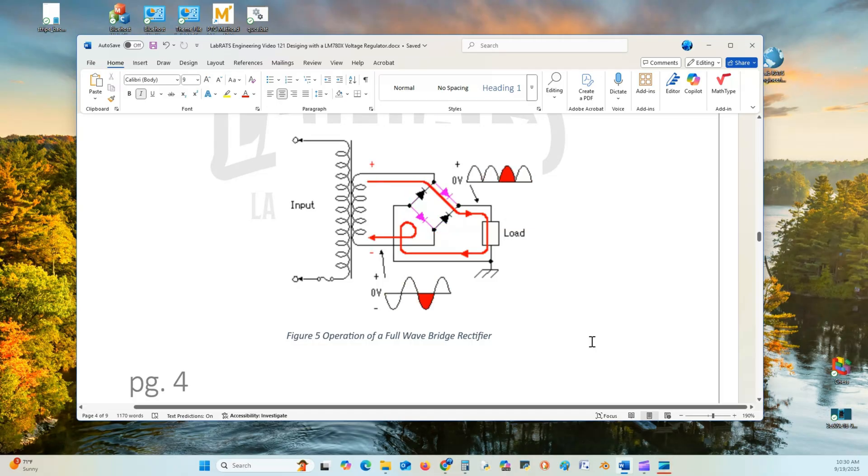The next section of the power supply is the full wave rectifier. As you can see, it takes the peak-to-peak input AC voltage and forward biases diodes 1 and 3 on the positive cycle, causing a positive peak to come out. Then on the negative pulse, it forward biases diodes 2 and 4. This creates a ripple of consistent positive peak voltages, all at 14.5 volts peak, which is 29 volts peak to peak, and it continues to repeat. That's it for the full wave bridge rectifier.